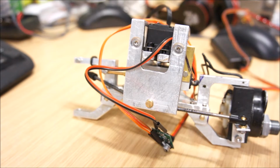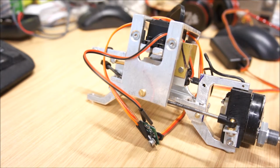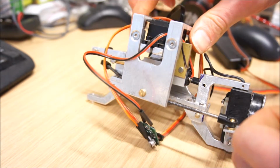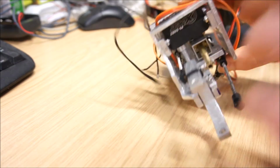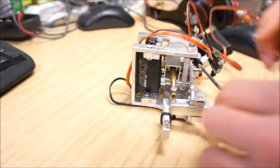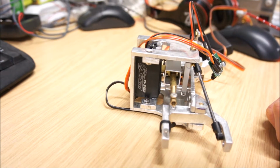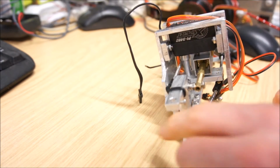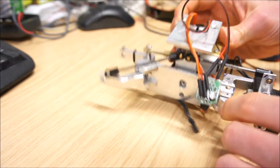I had to go to a high quality servo that can deal with that permanent force and permanent torque, and therefore the heat. And then as you know, the servos start buzzing, and it's all a bit annoying. So I thought, that is an ideal situation for something mechanical that is self-locking, either a worm drive, or what I'm using, a lead screw: an M3 screw going into a female thread in brass, so relatively smoothly running. I'll try to show some details later.